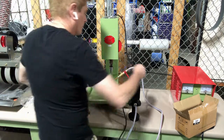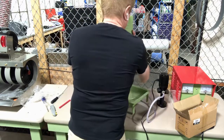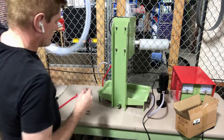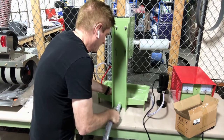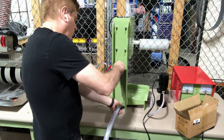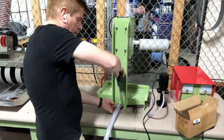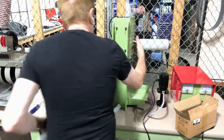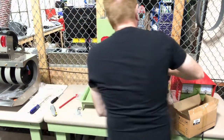At the back you'll see there's this pipe fitting — you could also plumb this, it's definitely a pipe fitting. In my case, I'm going to stick my hose clamp down this pipe, slip the pipe on the back here, and tighten that hose clamp up. This is going to be the return for the water and grit to come back down to my pump. We're just going to recirculate — pumping up the grit to the head and recirculating back down.